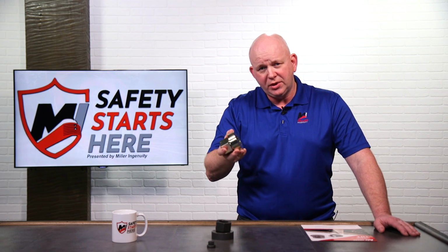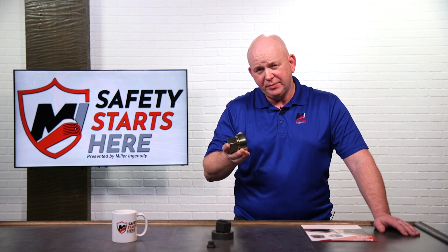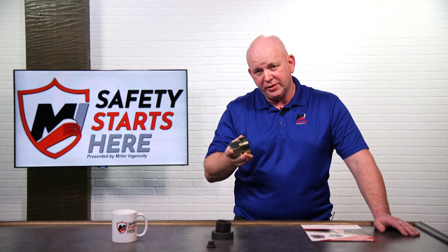And also when you install new tracks and switches, there's a famous double diamond in Illinois that these were tested on and approved by. So over time, instead of tightening up the nuts, they're only inspecting them for tightness. They don't have to go back and use a torque wrench or an impact wrench to tighten them up. They're just inspecting them because they put marks on them just to see if they've loosened up at all.